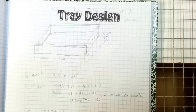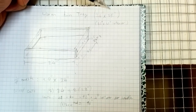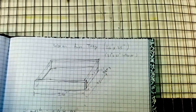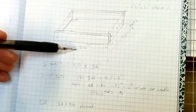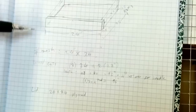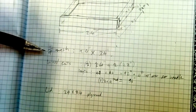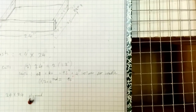So let's take a look at the design and all the pieces. Here are the dimensions of the tray — the outside measurement is 24 by 25, and the inside measurement is 22 by 21. There's a ladybug checking out my design as well. The front and back are 24 inches, and the two sides are 22 inches. The hardware cloth is one-fourth inch mesh, 24 by 24. I found a discount on a half-inch mesh, so I bought that and I'm using it.